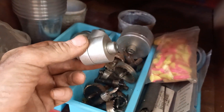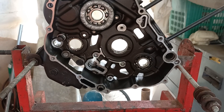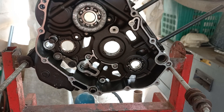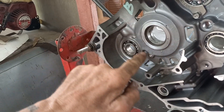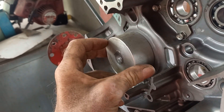I believe I came up with that one — but we're about to find out. Let's throw this down here. To save time I'm going to fiddle about and then show you what I've fiddled with. This is half of a dimple die. Basically what you're trying to do is get something that will sit on this side of the casing so that you can draw the bearing into it.